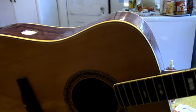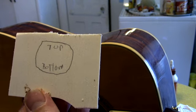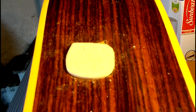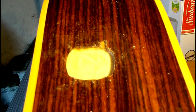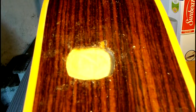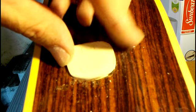Okay, I'll go down in the basement and cut that out. I'll sand it down with a piece of sandpaper and get it as close as possible. Okay, see ya. Okay, I'm sanding down this part here. I started out with a wood file, and then I went to just a fingernail emery board, and you can see I'm following my lines here. You can barely see the pencil mark here around the top, around the side, so it's getting close here, and it's just going to be a slow process to getting that to pop in there.